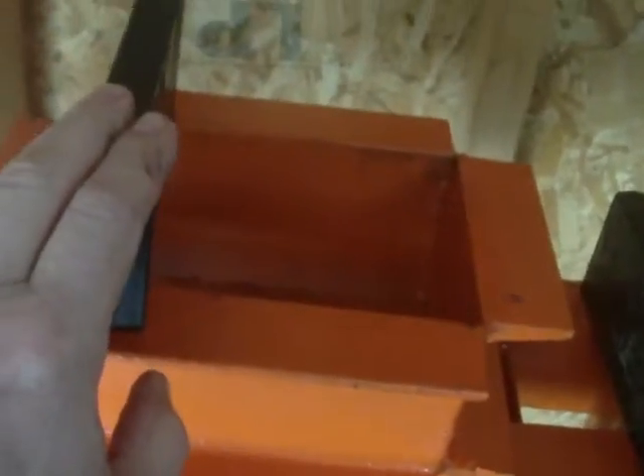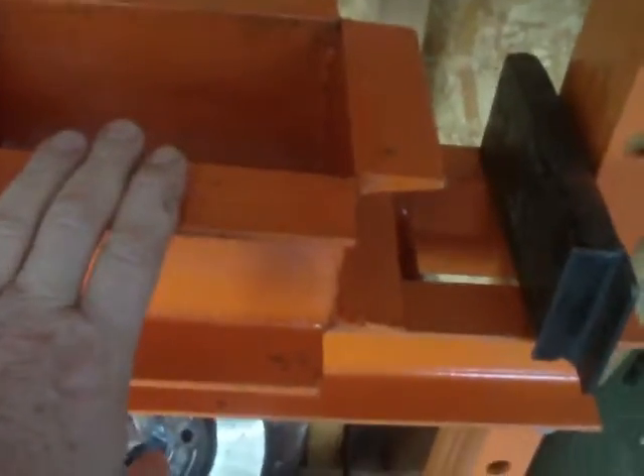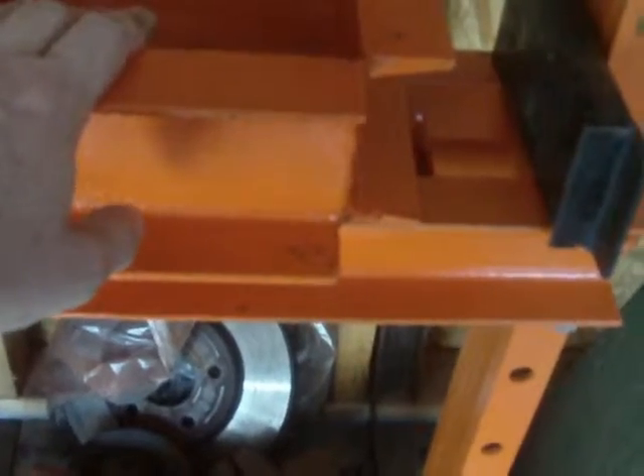You can see how it'll stop when you go sideways — there we go. Then you can lay your cage on top here, and you don't have to do what I was trying before without this piece, which was laying three-quarter-inch bars up and trying to hold everything while pressing. So build yourself an extension like this — the original bed is three-inch and I went to four-inch. You can even replace the whole piece with four-inch if you want, but this also gives you the option of having two different size beds to work with, and you can turn it sideways or on end to open up your options.